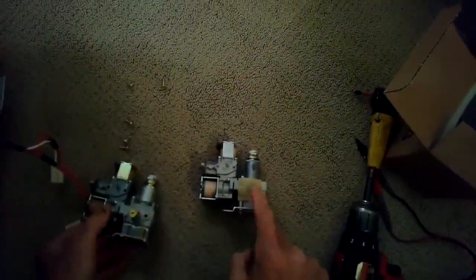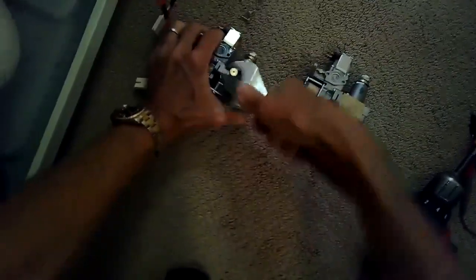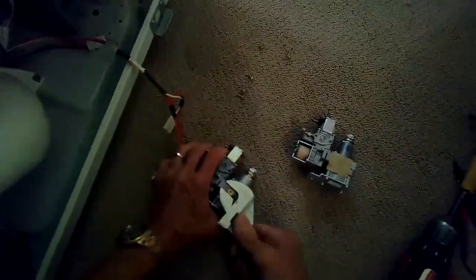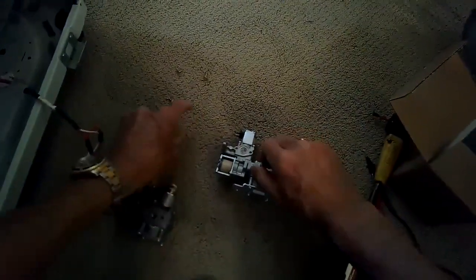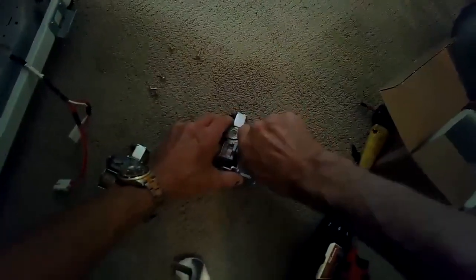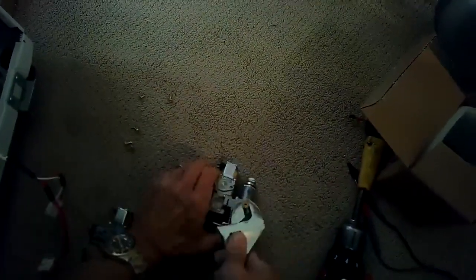We're going to try to take off this little orifice — take it off the old one and put it on the new one. It has a little tape in the way so we'll take that off. This is ten millimeters — use a wrench or a crescent wrench. Loosen that up, spin that jet off, and make sure it's clear by blowing through it. We're going to put it on the new one — it had a little tape to keep stuff from getting in there. Spin it on by hand, give it a little bit of a turn with the wrench, about three quarters of a turn — on nice and tight.